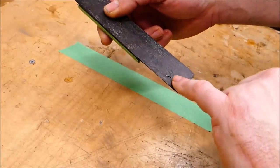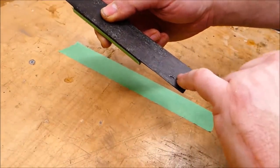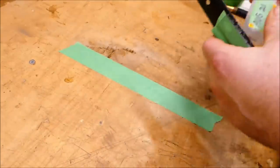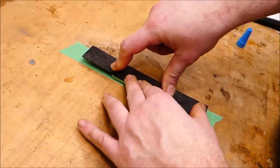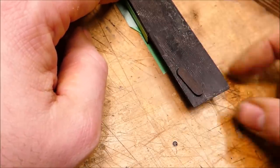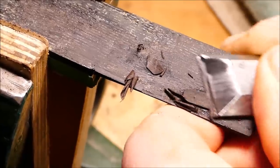This joint is still slightly tenuous and I want to make sure it's really well supported, so I'm going to inlay a spline. That area is under considerable pressure — if this ever comes up again I don't want it to break in the same place. I'm super-gluing this to my bench and I'll build a platform around it to hold my router in position and make a shallow recess. Then I can carve a plug to fit — that goes in there very nicely — and I'll pare that one down flush. Lots of paring going on in this episode.